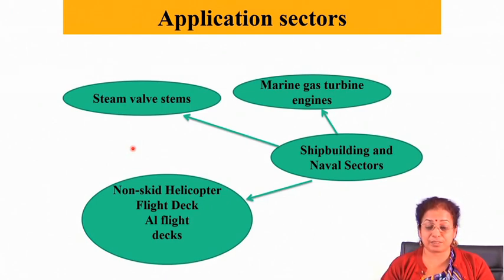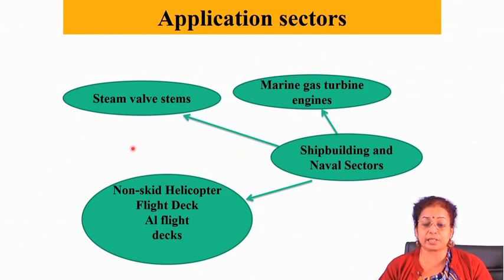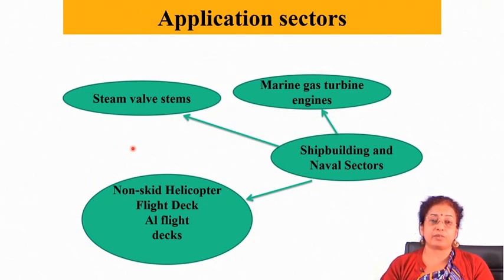It is important to prepare the parts very nicely prior to plasma spraying or thermal spray operation. In the shipbuilding and naval sectors, there are many problems of erosion, corrosion, and cavitation erosion, so there are many applications of thermal spray deposition. Sea propellers in marine environments face pitting corrosion and microbial corrosion, so sea propellers are cladded or sprayed with copper-nickel alloy to increase antibacterial corrosion resistance, and also coated with metal matrix composite by HVOF spraying.